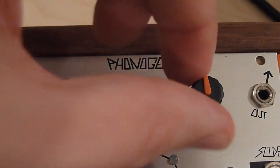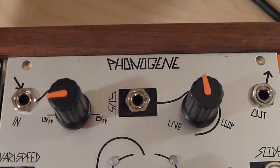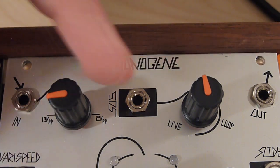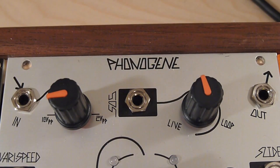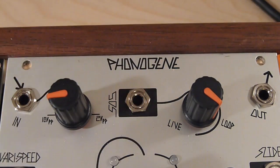The Sound-on-Sound CV-in is a 10-volt normal connection. If you input a control voltage here, this basically becomes a control voltage attenuator. It's also very useful as a built-in output VCA — turn the control all the way up, put in an envelope signal, and now the output will be unheard until you fire off that envelope. Essentially a built-in linear VCA. Very handy.